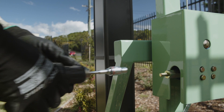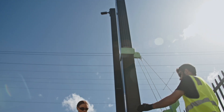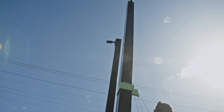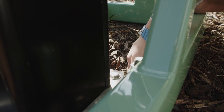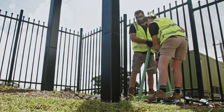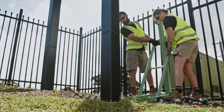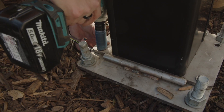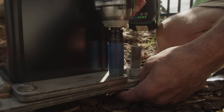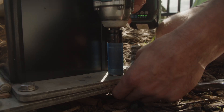Keep the winch system connected to the pole while using three sets of 3 ¾ inch bolts, nuts and washers on opposite sides to secure the two hinge plates together. The PowerGen winch and grip sleeve can now be removed from the PowerStack system. Use the remaining three sets of 3 ¾ inch bolts, nuts and washers as shown to further secure the two hinge plates together.